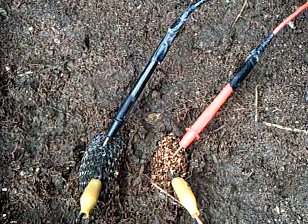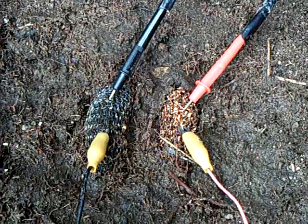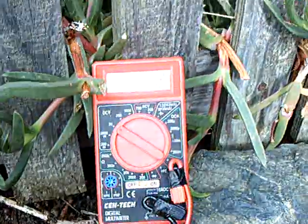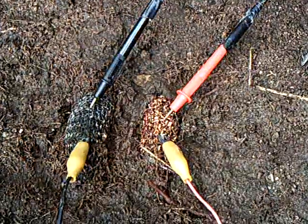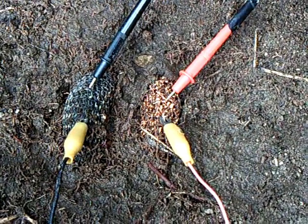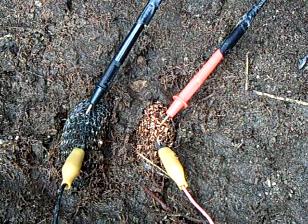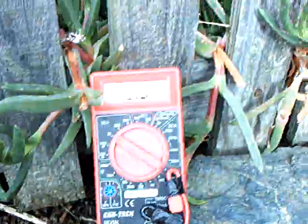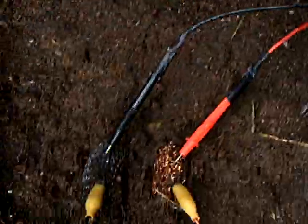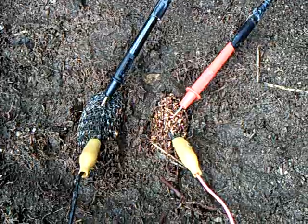This is the first time I actually put something in the ground. I can bury that completely, put wires on it, and get the same result. So probably what I'm going to do is bury those a foot down, or at different elevations like a true earth battery pointed north and south, and we'll see what kind of voltage remains after the galvanized coating goes away and it's just steel and copper.